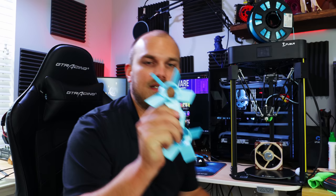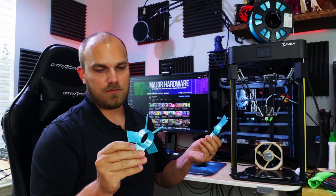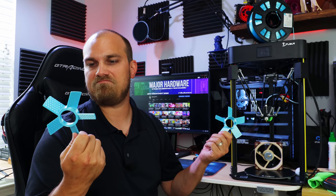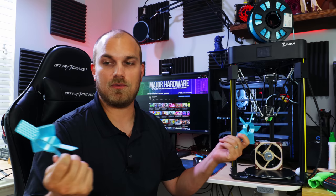So now, to test RPM, I guess we'll use the same motor hub, so I'll just take the fans off and on, the same motor, since there's one already installed on the radiator. We'll just spin them up, see if they're any different, because the idea behind the golf ball design is it causes less drag and maybe cleaner airflow. Who knows? We're going to see here. Less drag should equal higher speeds, and if we want to keep it as consistent as possible, we'll use the same motor so we don't have any differences in the manufacturing of the motor itself.